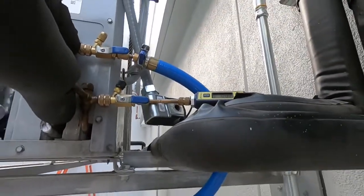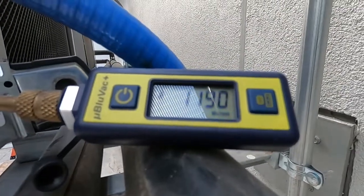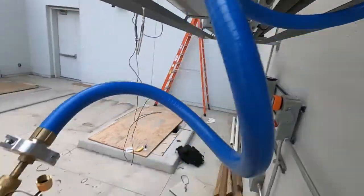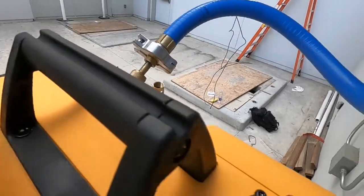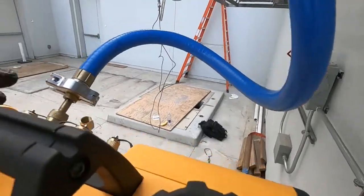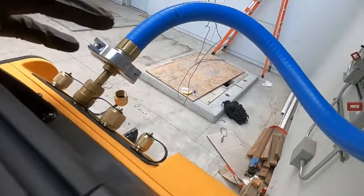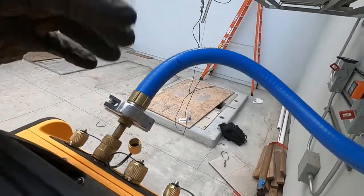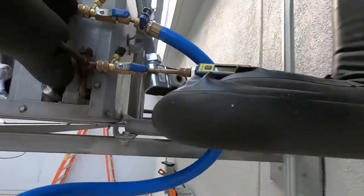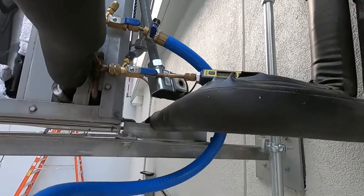Taking a little longer than I thought it would be. You can see we're at 1200 microns, not 100. It's only been a couple minutes, but it's pulling down pretty good. Nice pump — not too heavy. I like the access ports right here facing out this way, instead of having a T like I have on my JB to connect on the sides. We'll give it a little more time to get down to 500, do a decay test, and that's it.